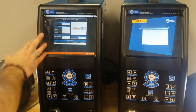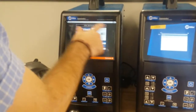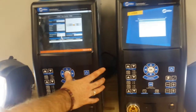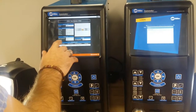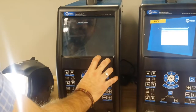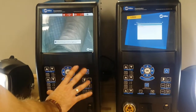So this is the screen. If you ever want to calculate the settings for your TIG, you need to go find the information on the screen. I'm going to put a thing up on Blackboard soon that shows you how to do it, but the calculator is there and you can probably figure it out right now. Basically you're going to look at the metal you're using — carbon steel — the thickness, what kind of filler classification and diameter you have, and it will tell you how much gas to use, how much voltage, and all that.